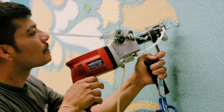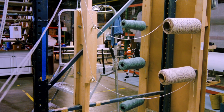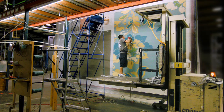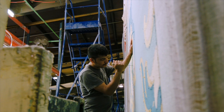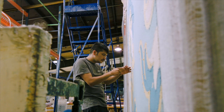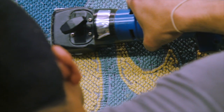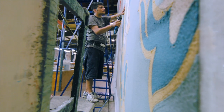A mender uses a handheld tufting gun to fill gaps with the matching yarn. Mending is the process of hand refining a design after tufting. Some gaps are too small for the tufting gun and must be filled with a single tuft needle. Finally, a hand shearer must be used to remove excessive yarns and also create a smooth back.